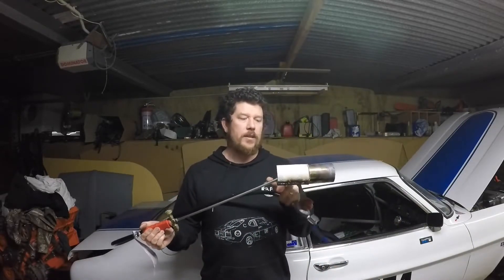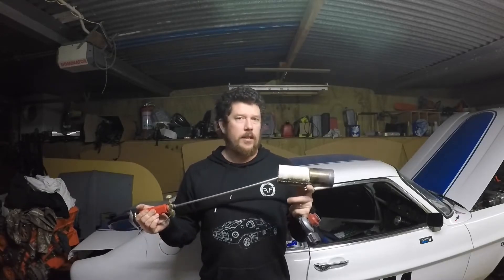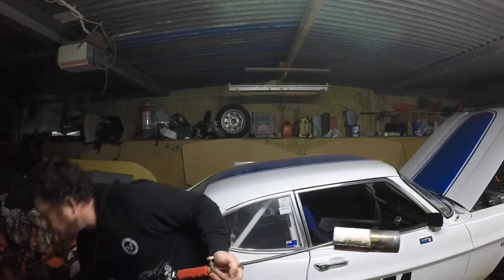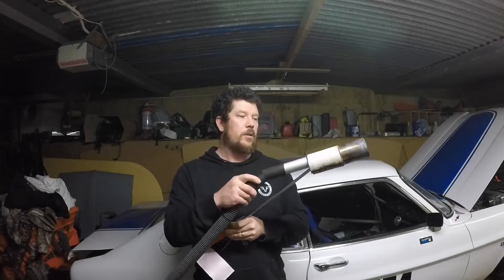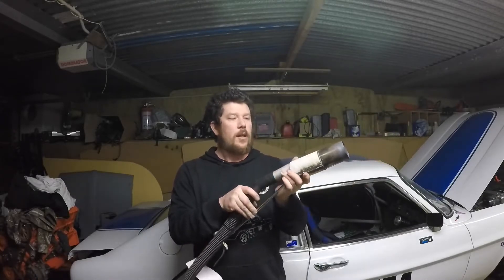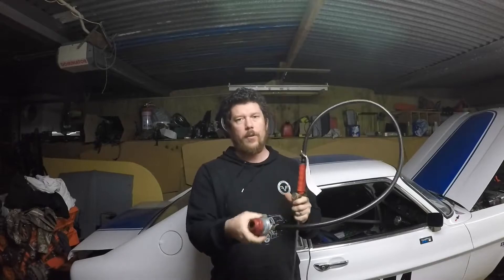The first thing I needed to do was make a bunch of parts so I could actually melt some alloy. It's one thing having a furnace but you've got to have some equipment to use it, and the burner is a key part of that. I showed this really simple weed burner when I made the furnace. I've made a crude addition to the back of it because this weed burner won't suck oxygen in. I've got around that by using the shop vac hooked up to the back — it blows air in and funnels it through into the furnace. Really supercharges it well. The other thing was it came with no pressure regulator, so I've added a 30 psi unit to make sure we had plenty of gas pressure and flow.